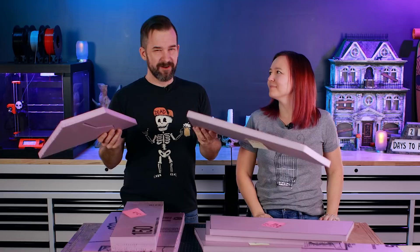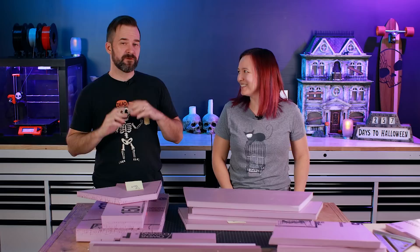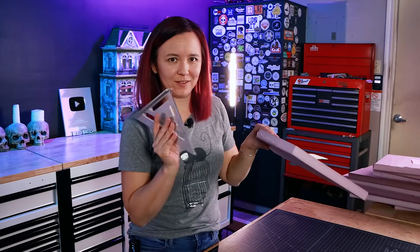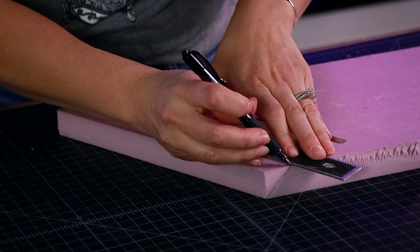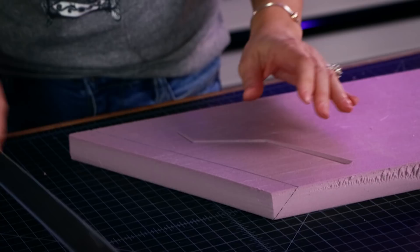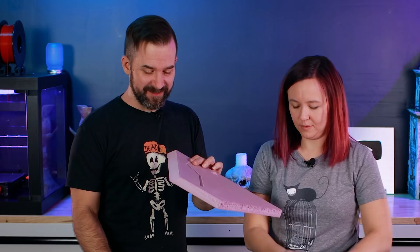The next thing is these pieces have to be angled — they go together and it's not exactly 45 degrees, more like 44.6, but this pirate treasure chest has been sitting at the bottom of the sea so 45 is good enough. To cut our angles we can use a knife, a table saw, or a bandsaw. We'll show you a simple way: use a square shaped like a triangle on the edge to mark the cut line, connect the lines on the back side, cut with a knife, then clean up the edges with a rasp. No saw, no problem.